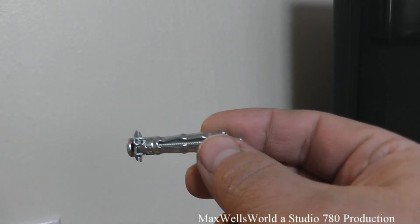Out of all five of those holes, one of them was bound to hit some kind of structure, so I should be okay. But failing that, I do have these hollow wall anchors that I can drive in, they mushroom out, and they'll be good to go. So I'll grab my drill and drill bit, drill five pilot holes, see if they come up dry or not. If they don't, we're good; if they do, we've got to put the anchors in the wall.